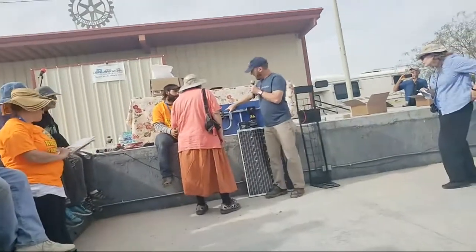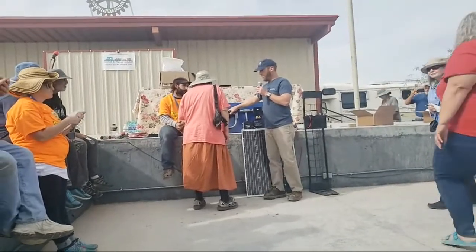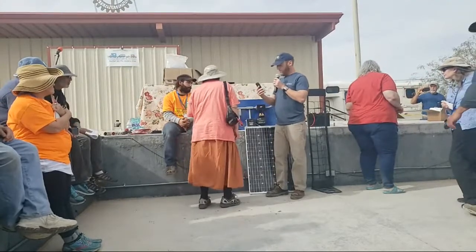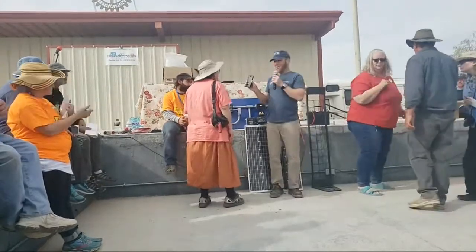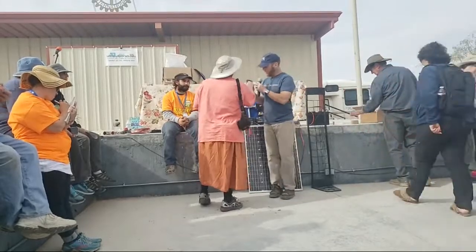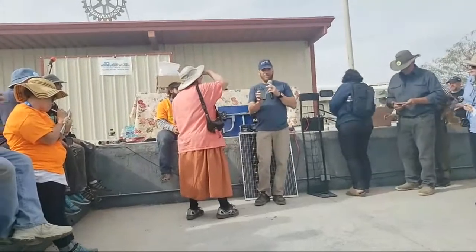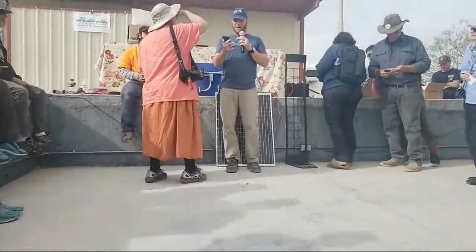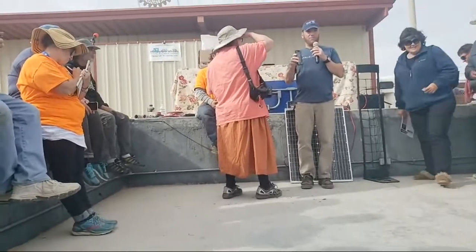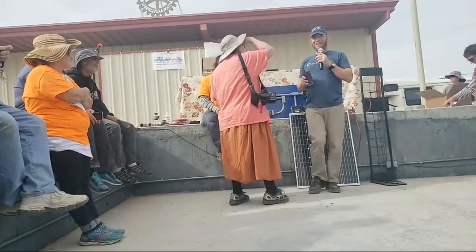Now on the 3009, if both the absorption and the float light are illuminated, that means you're in bulk mode. You're providing constant current, trying to raise the battery voltage. Of course, you can also look at the app, and it says bulk mode and your battery voltage. I don't want to go too deep, but the app is actually pretty in depth. You can go to different screens. It'll tell you tabular data of your battery voltage, input current, output voltage, but also graph it for you.